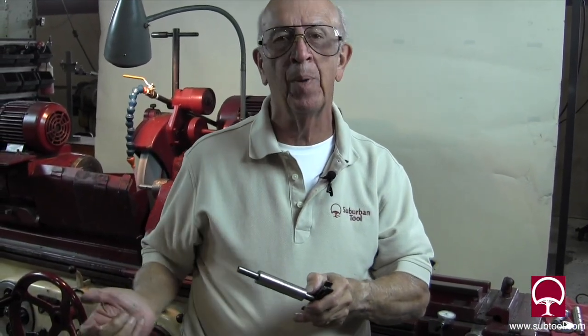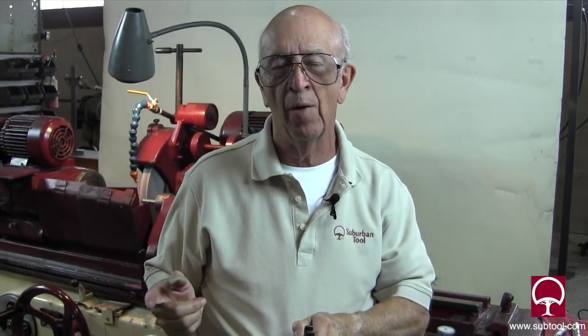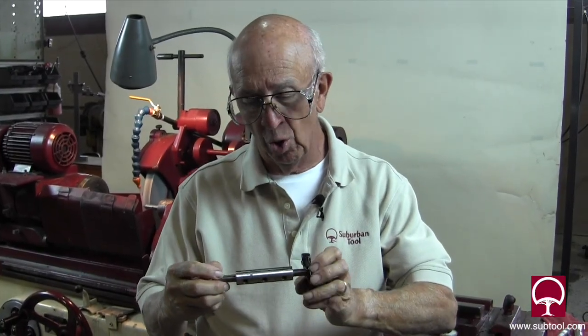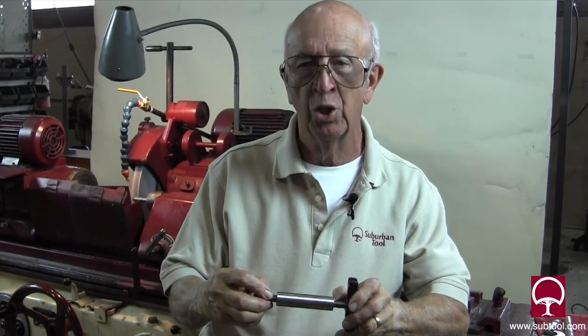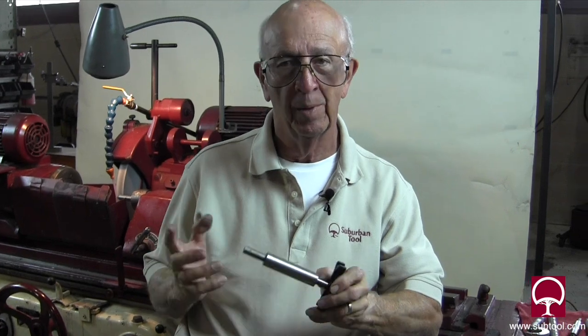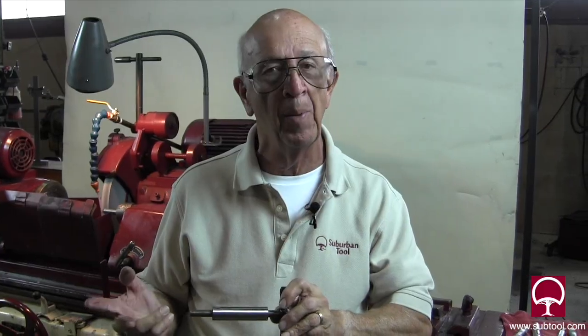So that's one way to grind on the OD grinder — fast and accurate. Take a couple of passes: take one major pass, take all the stock off on the first pass, and again, this is not true with everything — it depends on what you're grinding. In this particular case we can do it that way. To do this whole thing, I would rough this in, grind these two ends, come back and grind the OD and finish it. But for the purpose of the demonstration, to give you an idea about how you can take a couple of passes and complete your size — that's why I did it this way. Fast and accurate on the OD grinder. Thanks for watching.